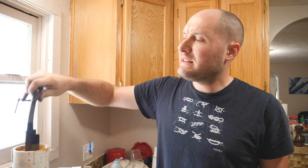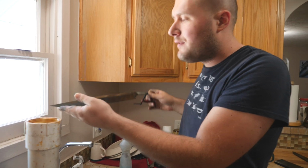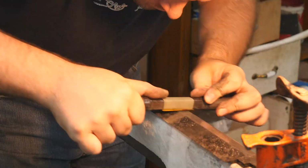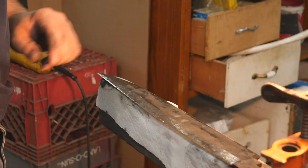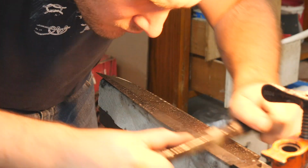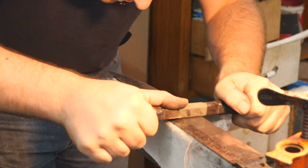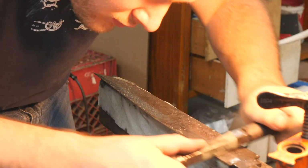It's about 10 minutes later. Taking the blade out for what should be the final time. It's looking nice. I'm gonna go through all that sanding that I did before, only with 3000 grit, and then I'm gonna buff the blade a little bit, and we're gonna get it in the coffee to darken it up. Instant coffee, highly concentrated.